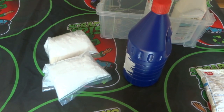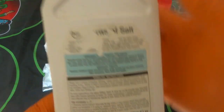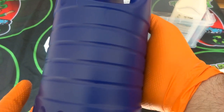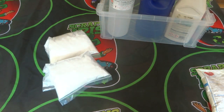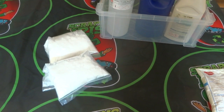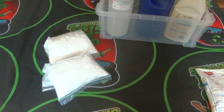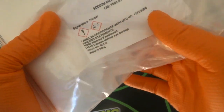Once the foils have been removed from the fingers, the second stage is dissolving the foils. For that I use bleach and hydrochloric acid — a normal household bleach with no additives, no fragrances, no lemon freshness, just a regular straightforward bleach. Hydrochloric acid and bleach together will dissolve the gold into solution, so you'll have your gold and impurities in solution.